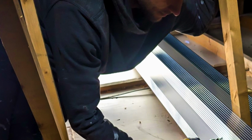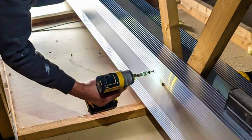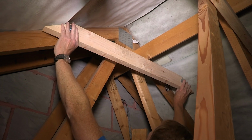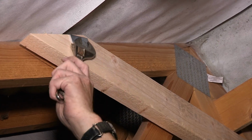Where the truss braces meet the bottom chord, holes are drilled through the telebeams and fixed to all brace points. Ceiling collars are installed to the specified height throughout the roof, with collars bolted to the rafter section of each truss.